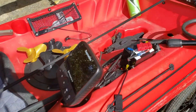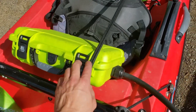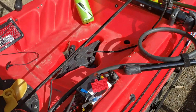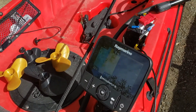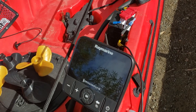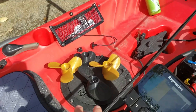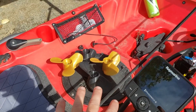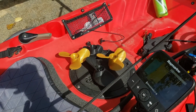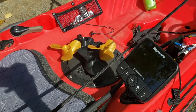The cable runs up and sits in the battery, which is just sitting in the passenger area here. That's all sealed. Coming back further, we've got a Raymarine Dragonfly sounder plotter — this is like a heads-up display for our speed — and this is just temporarily installed. Got a few spare props. I'm not going to experiment too much with those today; that'll be another video on prop sizing, pitch, and how it affects your current consumption.